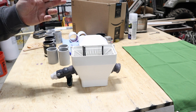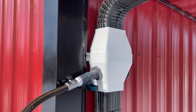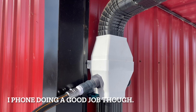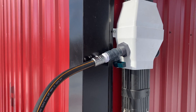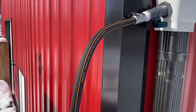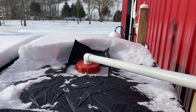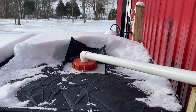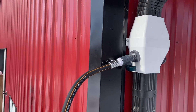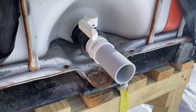I've got to figure out how I'm going to plumb from the diverter to the rainwater containment totes. It is so cold out here today that my camera decided it's not going to work, but I've gone ahead and put in that rainwater diverter at the top of the downspout at the corner of the barn. I attached the garden hose, run that down into a piece of one-and-a-half inch PVC that goes down to a one-and-a-half inch 90 with a little stub. I do have a filter to put in there as well.